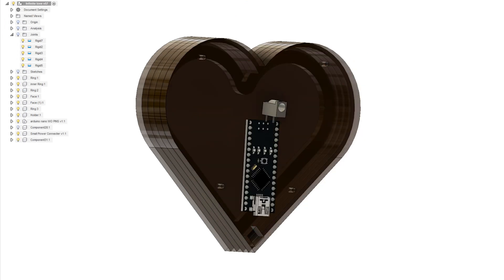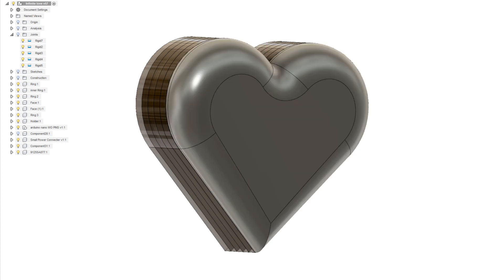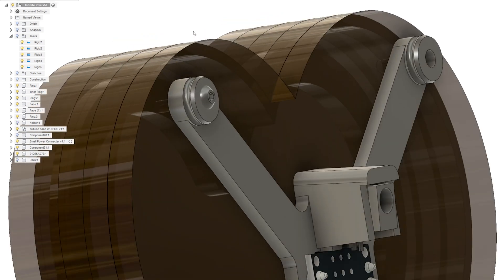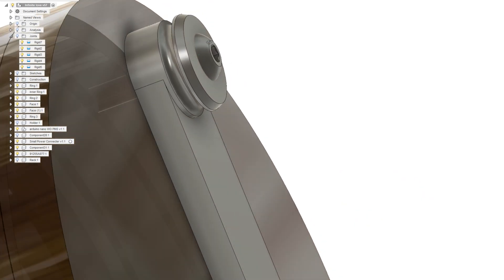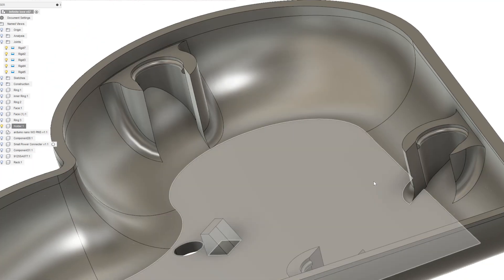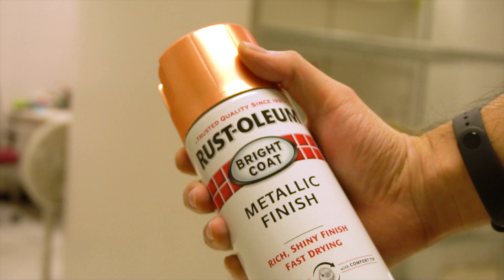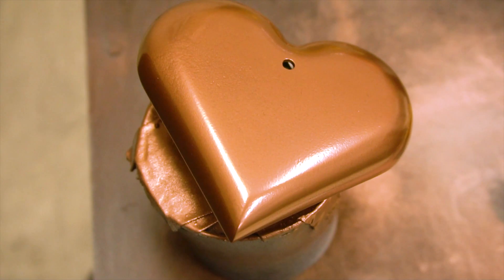We also need to fix all the layers together. I was hoping to use copper tape, but it is too thin and creates a lot of cracks and creases. I ended up using double-sided tape below the copper tape substrate and applied the second tape along the side. The next is to work out the rest of the parts that hold all the electronics. I have a piece that holds the Arduino Nano and the 5V power jack, the shell itself, and a little stand. On each of the four pillars on the holder piece there is a tiny groove, and on the shell corresponding features with lips to make them a press fit, so I can open up later for programming and updating. To make the shell prettier, a couple rounds of priming and sanding were done, and I sprayed a copper color to match the sidewall.